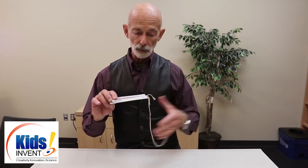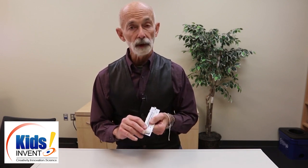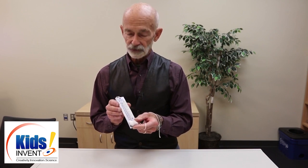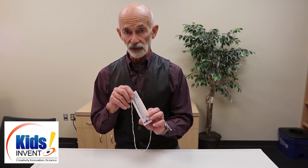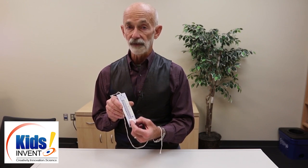This will always be wet, and as the students sling this around in a circle, some of the moisture in that cotton ball will evaporate. It will continue to evaporate until the air around it is completely saturated. If there is 100% humidity already, then we won't have any evaporation, so we won't have any cooling and the two thermometers will read the same. If the air is completely dry, then the wet bulb thermometer will show a big decrease in temperature because much of the moisture in the cotton ball has evaporated, cooling the thermometer.